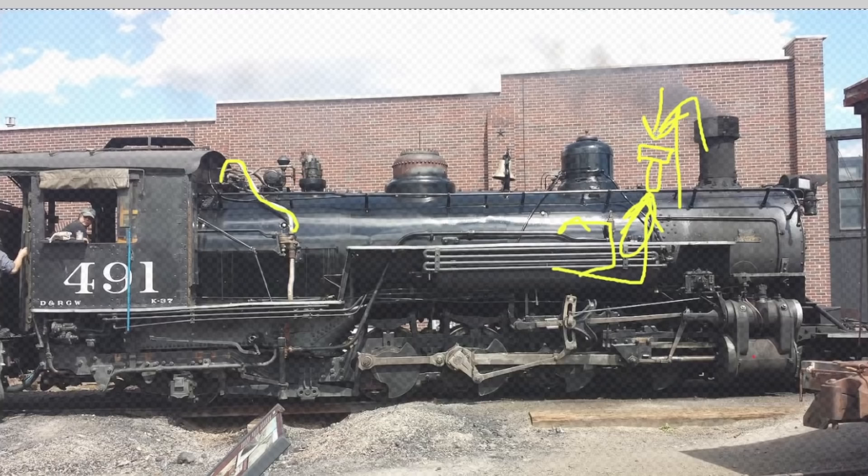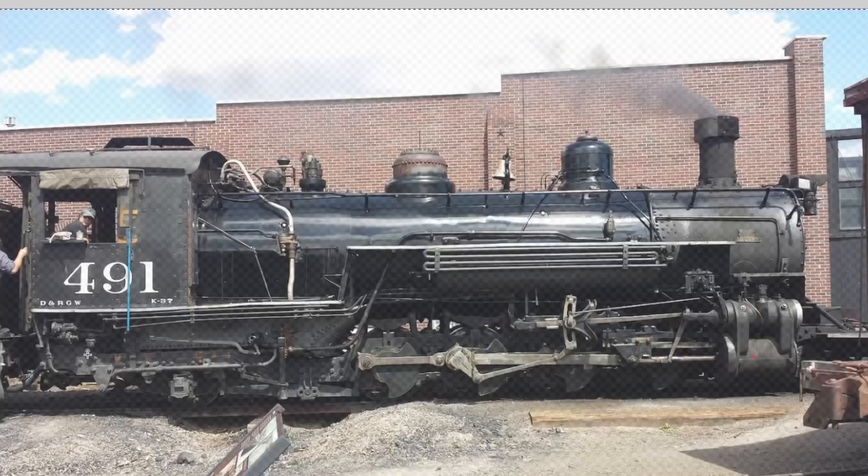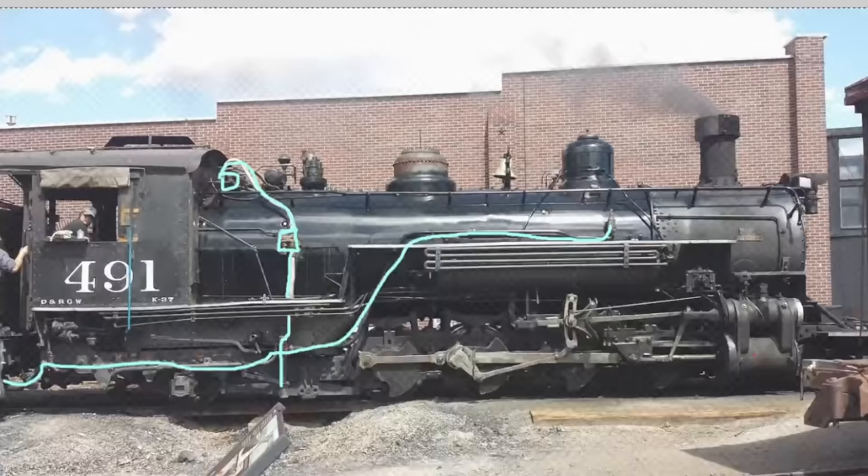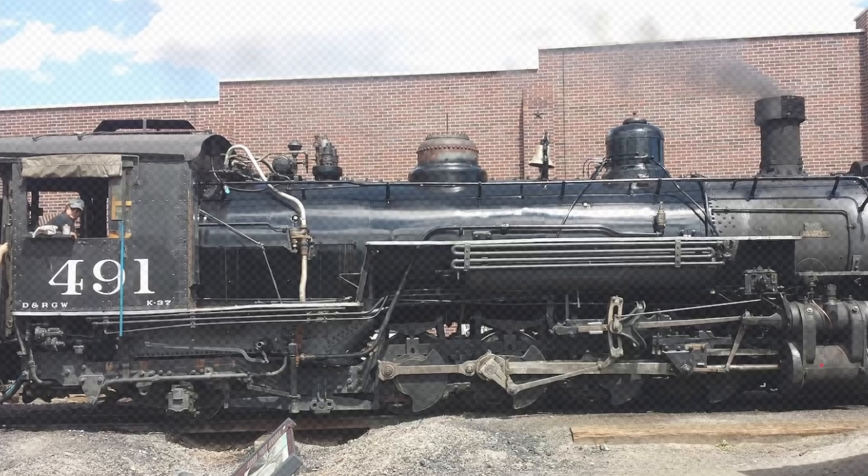The check valve is a steam pressure valve — boiler pressure holds it closed. But when you hit it with velocity and pressure, it's enough to pop it open and start putting water in the boiler. When you shut the injector off, you remove the pressure and boiler pressure pushes the check valve back closed. The turret is where the other appliances get their steam on a locomotive — basically a box with a bunch of valves on it where you get all your accessory steam categorized in one place. You'll have a pipe from the steam dome running to the turret to get the cleanest steam, then it's a manifold for your various appliances.